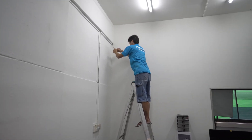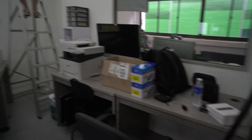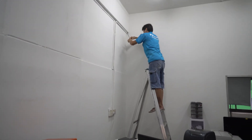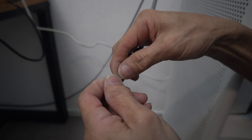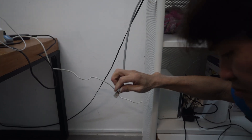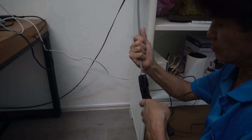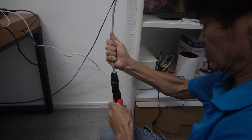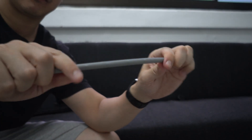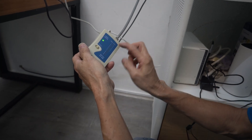There's my trusted electrician helping fix up the cameras. I'm not confident drilling while standing on a high ladder in a tight space. He's now doing the wiring and clamping in the office room. These are CAT6A shielded cables, which are much thicker than standard cables. There are a lot of protective materials inside that make the cable more durable. Shielded cable is actually very good, especially when running PoE — it's recommended to use at minimum CAT6 for PoE. The downside is it's really hard to manage in tight spaces, and my electrician had to redo the clamping several times.